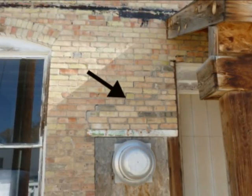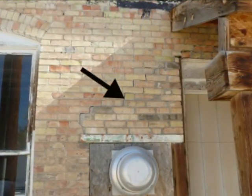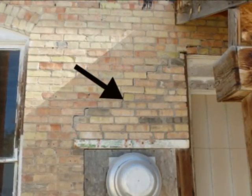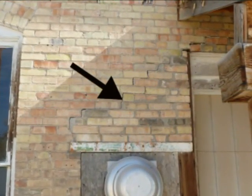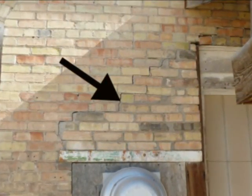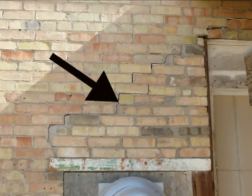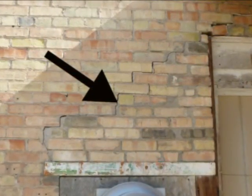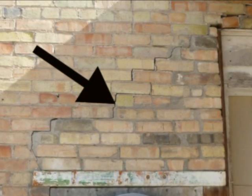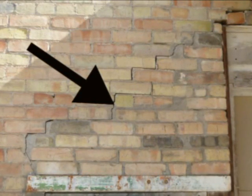So there are a few things — I don't just want to blame this on the wood post. However, I would like to point out, reiterating the reason why I made the video, is to avoid using wood if possible in a situation like this, to avoid the possibility of the wood shrinking and leaving you with a nice sized crack in your wall that could create a variety of other problems with the building.